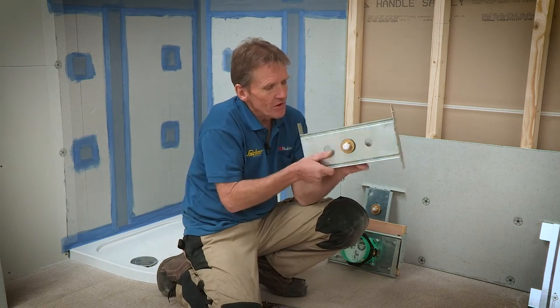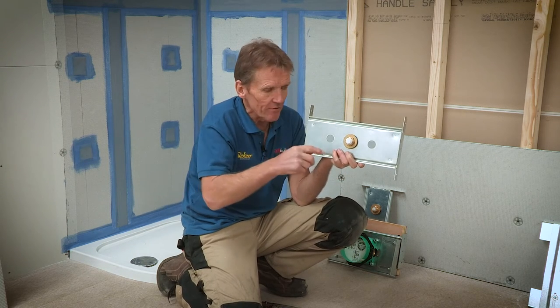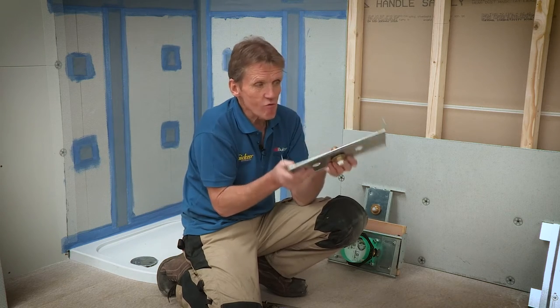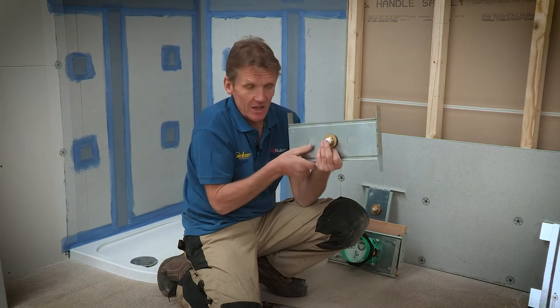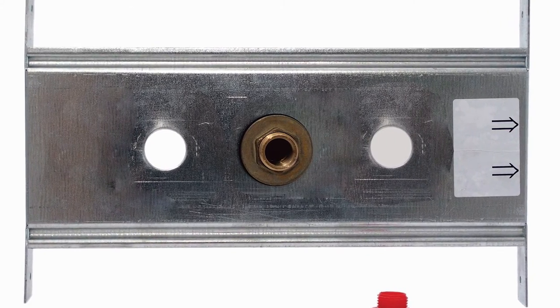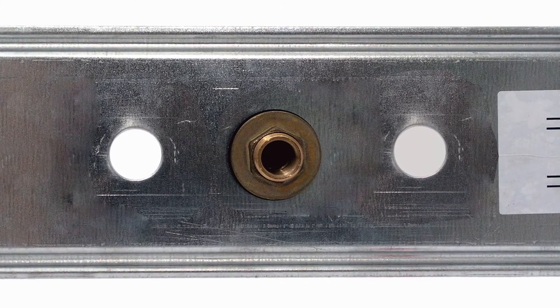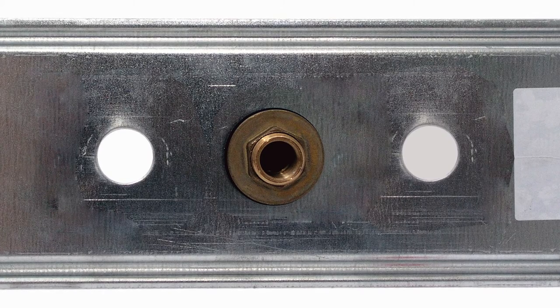And when it comes to doing the shower head itself, rather than having that pipework hanging on the plumbing with all the risk that that involves, we've got a good mounting plate — really solid and adjustable — which you can mount between the studs. That allows you to put any shower head arm onto there, just plumb it in. It actually screws into the female thread there, not the external thread — that's for the adjustment.